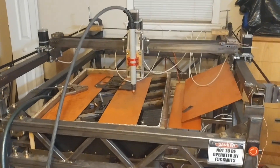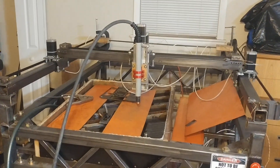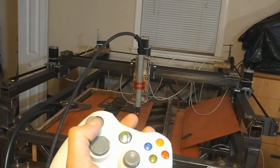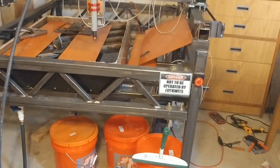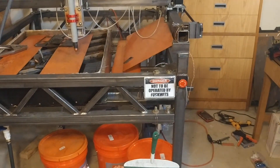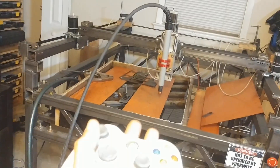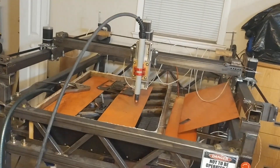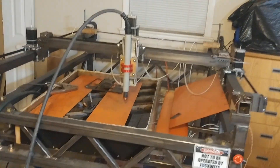I've made a lot of progress lately on the CNC build, so it's time for a few updates. Probably the coolest thing I've added is the ability to jog the machine using an Xbox controller. This is plugged in via USB to the computer running LinuxCNC, and with the program QJoyPad, I'm able to turn it into a keyboard emulator and send the shortcuts for jogging over to the Axis GUI on LinuxCNC to control the machine.